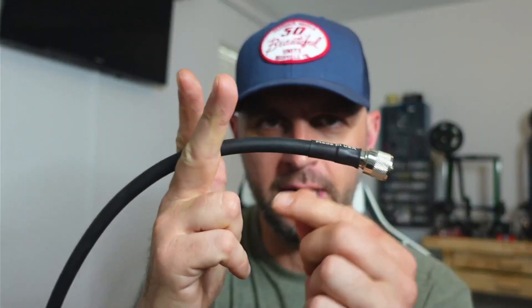There's an even cheaper option: ditch the SO-239 and BNC connector altogether. Take a short piece of old RG-58 coax — maybe six inches — strip it, and you have the braided outer shield as your counterpoise wire and the inner conductor going to the antenna. This gives you an end-fed half-wave that screws directly into the back of your radio, and you can probably find that RG-58 at Goodwill for free.